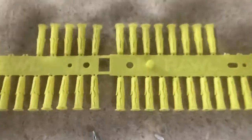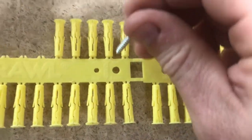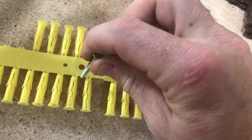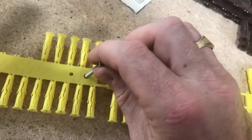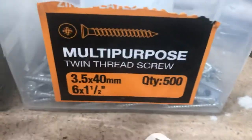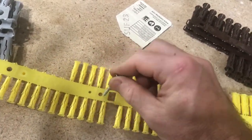At the other end of the strap, the other two holes — minimum and maximum — tell you the screw size. Let's get a screw out. Will this screw fit into the minimum hole? No, it won't push through — it's too big. And it's too small for the maximum hole. This said minimum 3mm, maximum 4.5mm. This screw was right in the middle — let's look at the box: they're 3.5mm screws. Funny that. So that's the perfect size screw — doesn't fit the smallest hole, doesn't fit the biggest, bang in the middle.